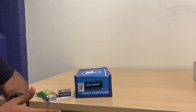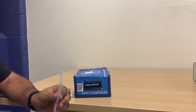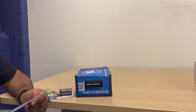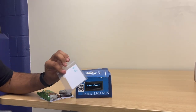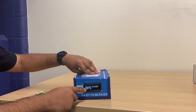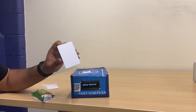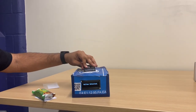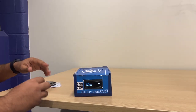The RFID scanner works by reading the numbers stored in these tags and transporting this information to the microcontroller using the SPI communication protocol. Here I have a tag that's mapped to rice. Putting it on top of the scanner shows you basmati rice, 2 pounds. Here I have something that isn't tagged to any item in particular. Putting this on top shows "item invalid," showing that it's not a valid item.